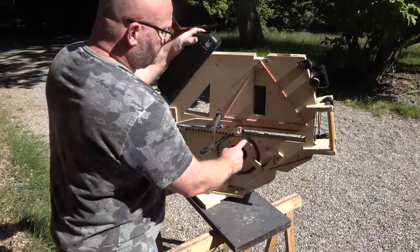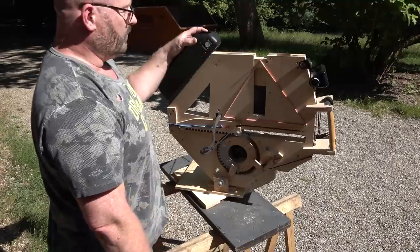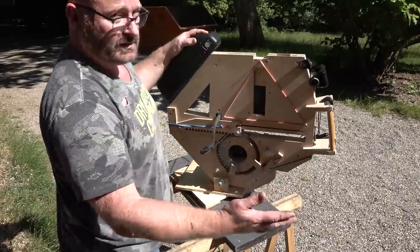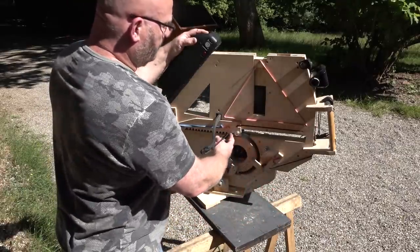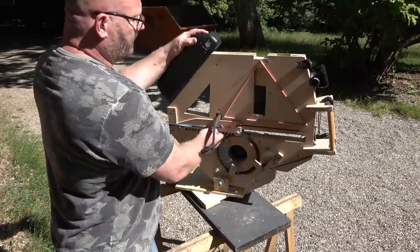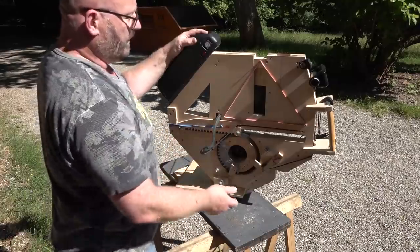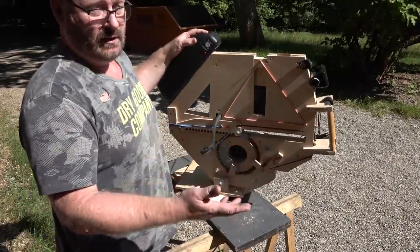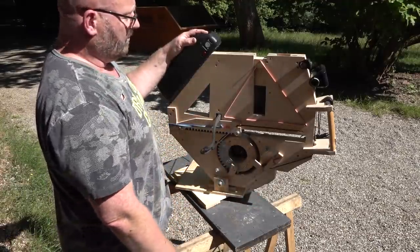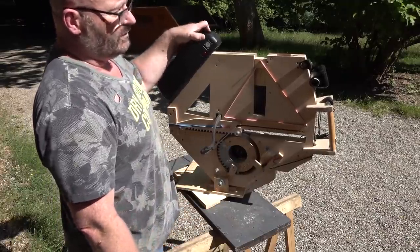Some people say give it a second set of teeth so that on each turn it fires twice. Well, in theory that would work, but not in real life. Because as you've seen in the slow motion, the sled needs some time to reset. Otherwise it would hit the wrong tooth, and that would be catastrophic. Yes, of course I could make the rubber bands stronger so it would reset quicker, but then there would be an enormous amount of strain on the end, because the entire sled crashes into the stopper every time. You can actually hear that this is what makes the shot loud — not the string snapping, it's actually the sled hitting the stopper. So this is also not really possible. This is about the maximum fire rate you can get from a machine like this.